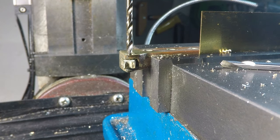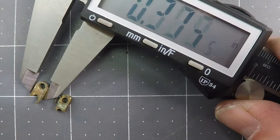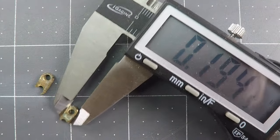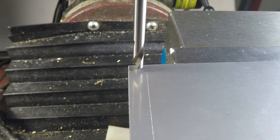Now I'm using a drill bit and using the mill as an arbor press to push out the hinge pin, and you can see it's mushroomed out on the bottom — that's what we want to do eventually. Note that these being handmade are completely different dimensions, but I don't think that matters a whole lot. It's just the hole spacing that is important.